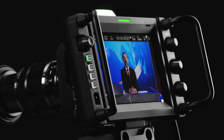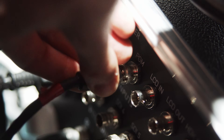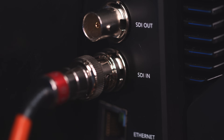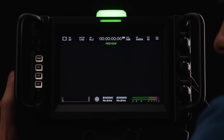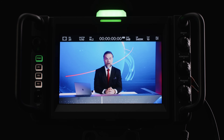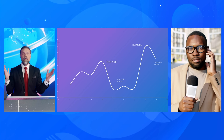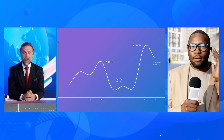Third, this camera can be used as a monitor. If you connect this camera to your ATEM's program output using the SDI in connection, the camera operator will be able to watch the show live. This is also invaluable when the director is pushing super source compositions, cropping the frame for picture-in-picture layouts, or adding overlays — the camera operator can see the live feed and adapt framing very quickly.